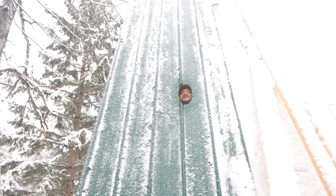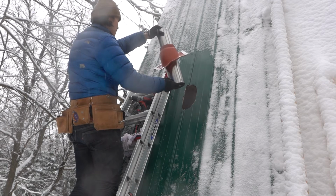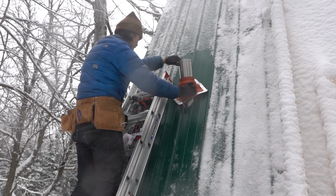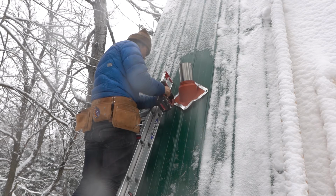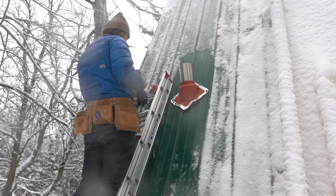With the roof cut, we actually ended up using the pipe protector. We put that through a gasket, and it was actually a steep angled gasket. With that particular gasket, we also ended up using some high temperature silicone, coated the edges of it, put it down on the roof, and then of course screwed it every inch or so with some screws that essentially matched the color of our roof there. Once that particular pipe protector was in place and the cathedral support was in place, we essentially had the infrastructure ready for the wood stove itself.